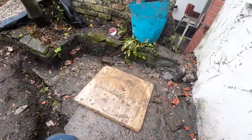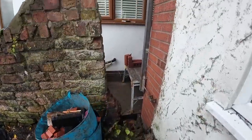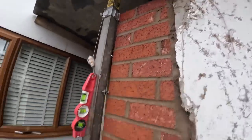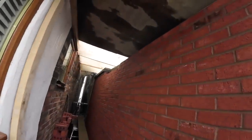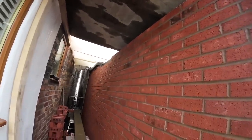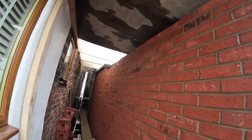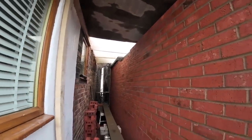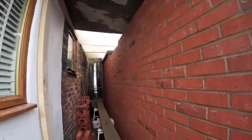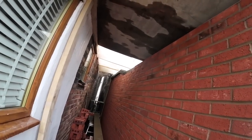Lunchtime over. Back outside. And we're up. So our height. So, well, we're nearly up. We're 4 bricks short with a mix. And pretty much every brick's damp, so it's not very good for jointing. I'm gonna have a go at it now, but I'm gonna drop inside onto the block work, get that ready, while Alex gets these 1, 2, 3, 4, that's 5 bricks in.